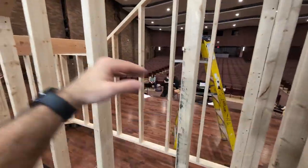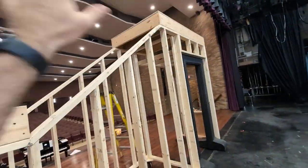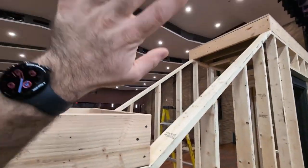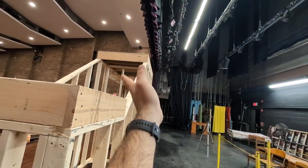So I'm only going to put one horizontal course on here because I want to get the stairs and that much more wall, and come back with a full sheet and put another horizontal course of full sheets on. There's no use in trying to make up the last little bit here or leaving a big sheet to wangle around for a few days before I get to the point where I've built all of that, and it keeping me from being able to get on this side and build.